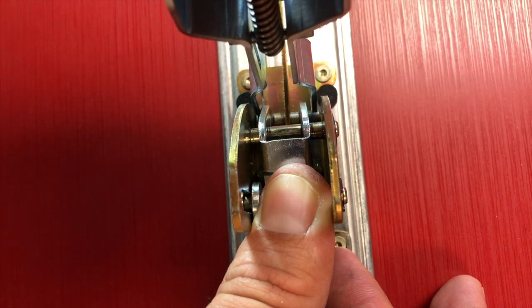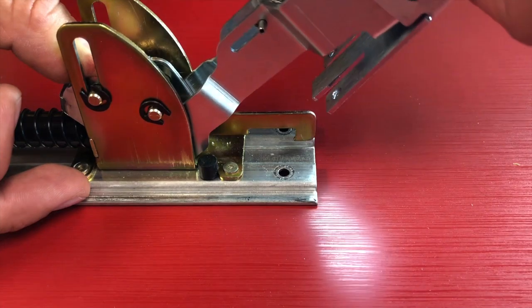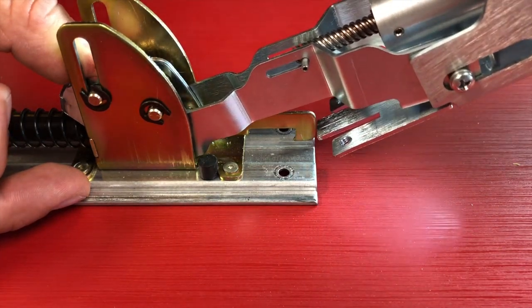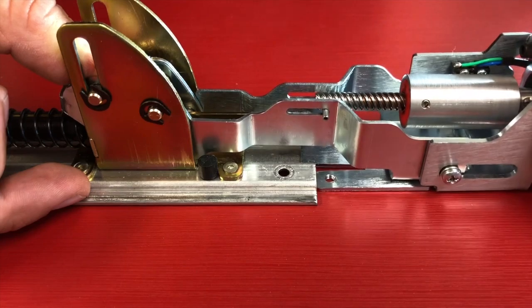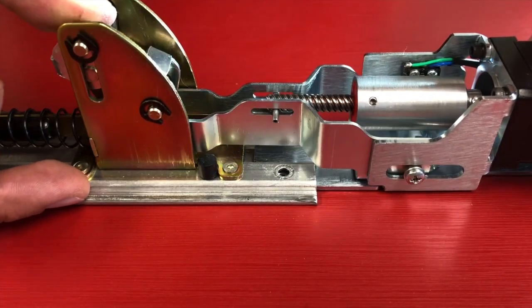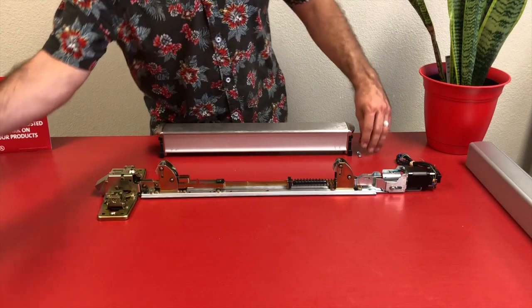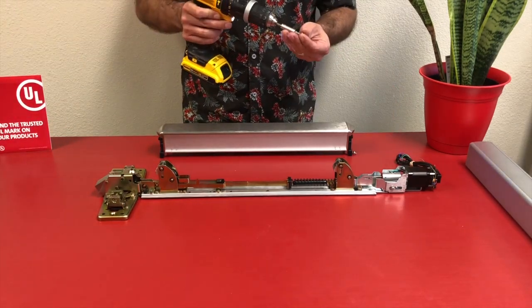That's what we're going to hook onto with our attaching hooks. Once we see them hook on there, we can start to drop down the back of the motor kit. Make sure we just miss that dogging piece — it does not get caught up on there. Our motor mount is going to slide underneath and into the existing grooves on the base rail.